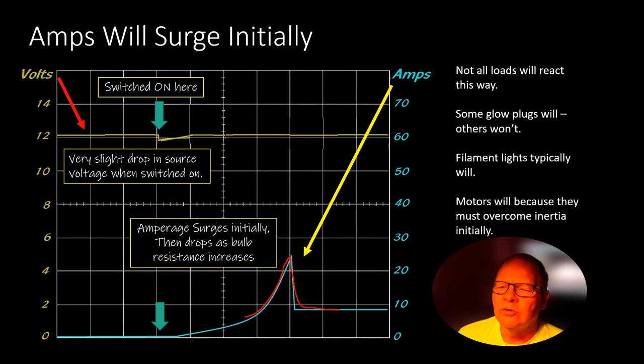The amperage surges initially. If it surges up to 24 amps and then drops down to 9.6, you've got to have a fuse that will handle that initial surge, or you'll wind up replacing fuses all the time. If you put a 15-amp fuse in here, it's going to pop when you turn on the light. It may not pop the first time, but it's going to weaken that filament a little bit every time. You might say they're only pulling 9.6 amps, I'll use a 10-amp fuse — well, that would be a non-starter.